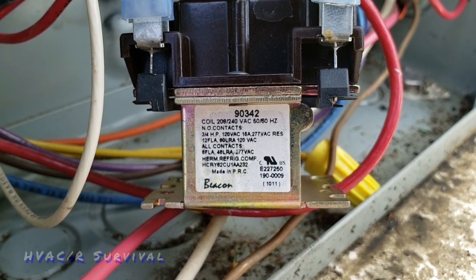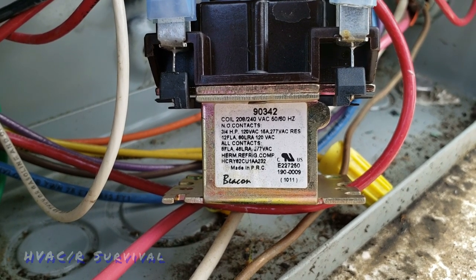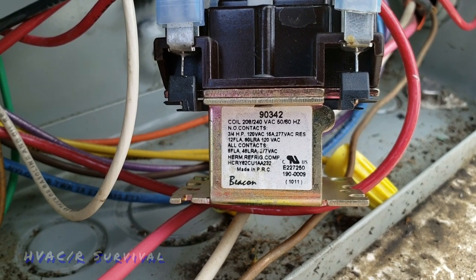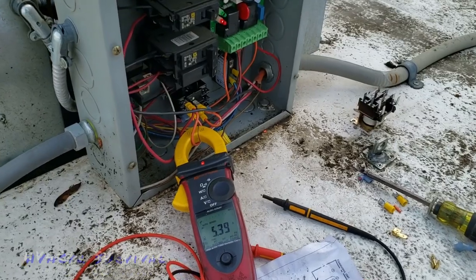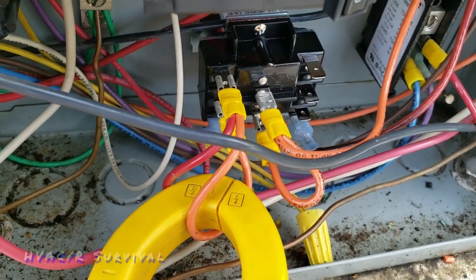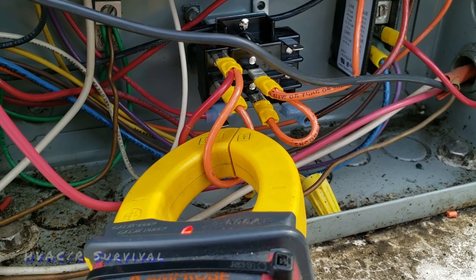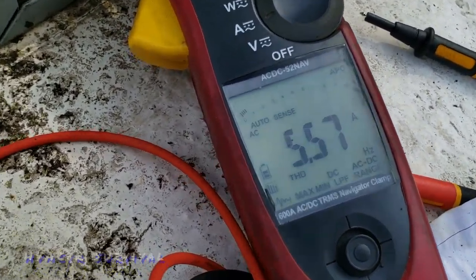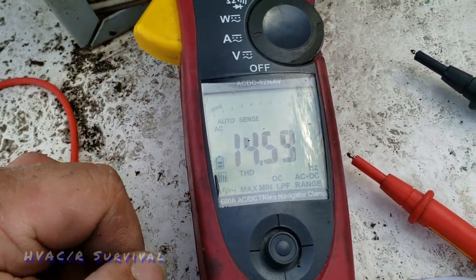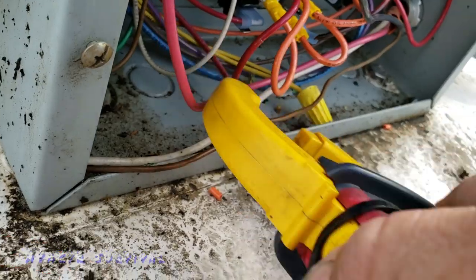There's a chance these contacts could be taking a dump. Since you've got two sets of contacts, if you divide it between the two of them you can split that amperage in half - it'll automatically evenly divide if you put power to both legs of the common and both legs of the normally closed. You'll divide it in half and get seven amps on each, giving you a little extra leeway. So we could have that relay acting up and not disengaging. As a precaution I went ahead and installed a new relay and doubled up using that other normally closed circuit. Power comes in on the right side on those two terminals, going out on the other two - powered by the clock when it runs. You've still got 14 amps total going through it but it's divided between the two of them, which will help save the contacts.